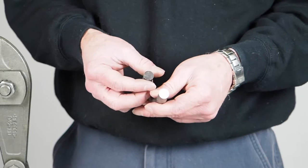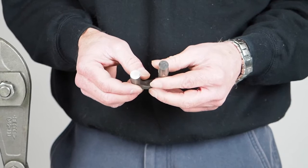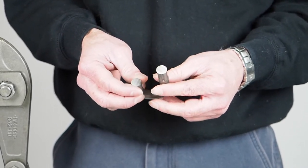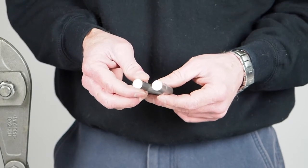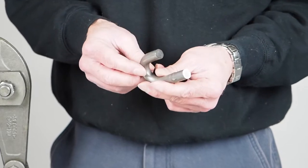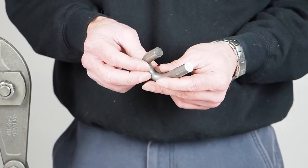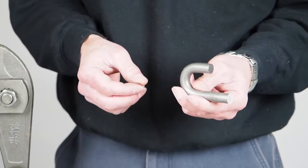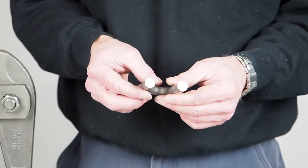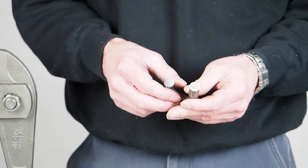Through hardening basically makes the chain hard all the way through. So that can produce a chain that's very strong in a tensile load, but it also tends to be very brittle. Since thieves often use freezing and hammering attacks to defeat chains — especially of this sort of gauge, 13mm, and even more so perhaps for thinner chains — we really don't want a chain that's brittle. That's a common problem with chains that have been produced for other purposes, as the requirements for security are different. That's why we buy this raw chain and we can do our own thing to get the right result.